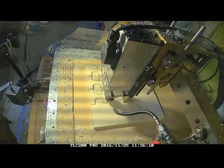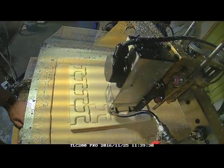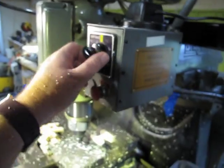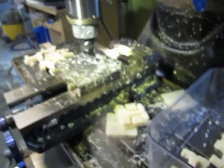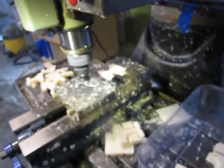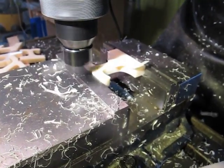With a little CNC like this, you've got nothing but time, so it worked out okay for us. We held these down with carpet tape and then left a little bit of skin, because if you cut down into that carpet tape, it gums things up — it's not good. And then we flipped them over in our big bridge port and cut that skin off.